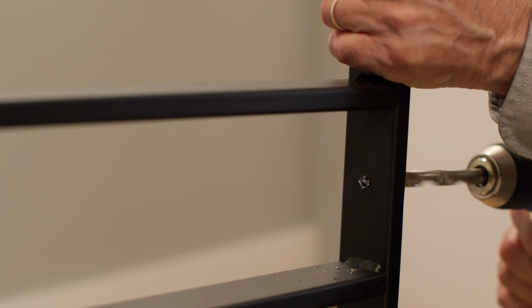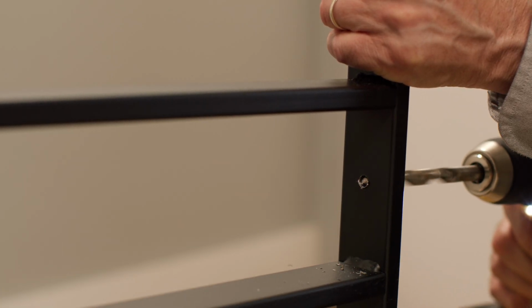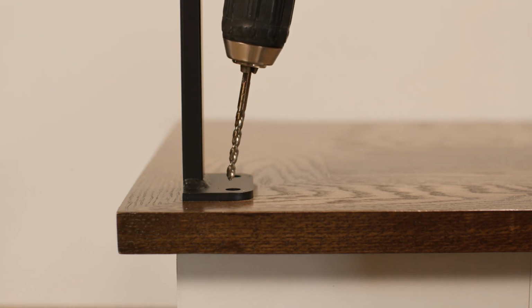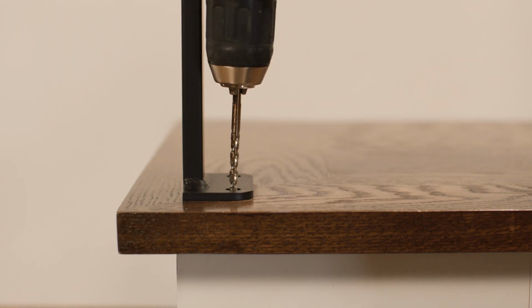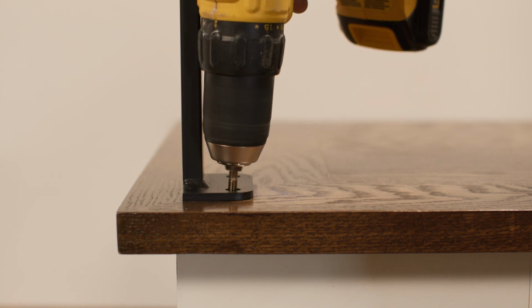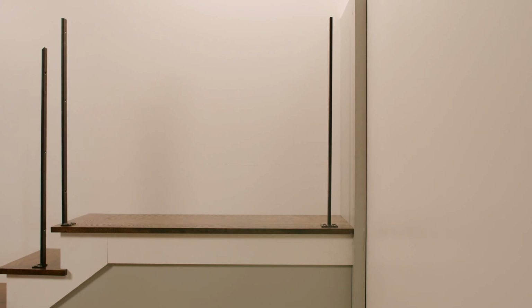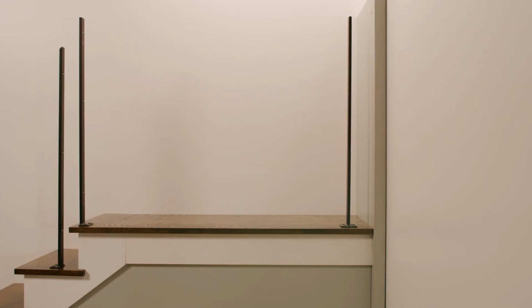Begin by drilling 3 evenly spaced 3/8-inch holes through both vertical ends of each rake and level panel. Position and mark the location of each panel post and drill 7/32-inch diameter holes, 2 7/8 inches deep, for the foot-lag screws. Temporarily mount each panel post in place.